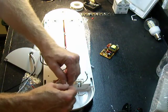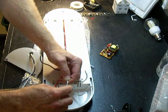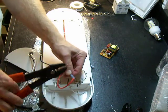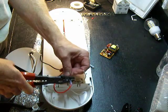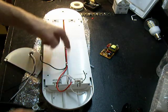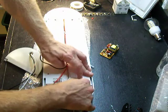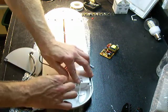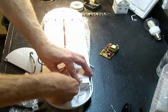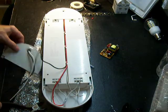What I do is I just take these two wires and twist them together a bit and basically put them into the other end of the butt connector here. In this case, I'm going to use a different pair of pliers — it's a little easier to get to. So basically now we have power coming from the switch on the red wire going to both ends of the tombstone. I don't require these other two wires going to this end of the tombstone, so you can leave those — I usually just leave them cut. You can tape those over or put some dead-end connectors on there. Okay, so that takes care of this end of the fixture.